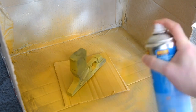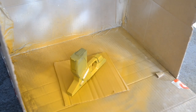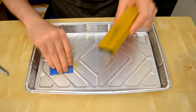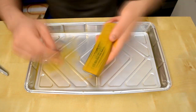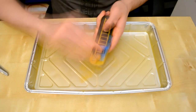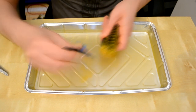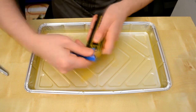Make sure to let it dry well before proceeding to the next step. When everything is all dry, I took a tray filled with some water and proceeded to wet sand everything with 240 grit sandpaper. Take enough time to make sure that all the parts feel really smooth. This process can require a lot of time — I think I did over 20 to 25 hours of sanding and wet sanding to be sure I was happy with the surface quality.